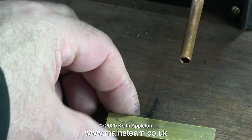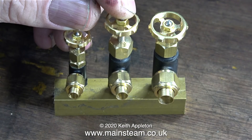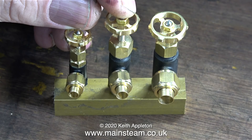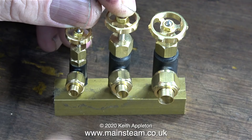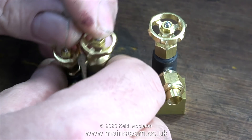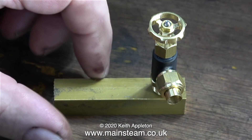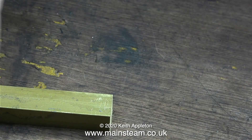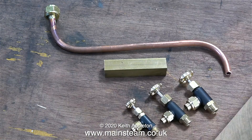I'm going to make a special three-way turret. Here's the idea: three taps — one 3/8 by 32, the second one 5/16 by 32, and the third one a quarter by 40. This three-tap turret will accommodate three pipe sizes: quarter, 3/16, and 5/32 inch. In this video I'm making the tap part; there will be a base, but I'll do that in a separate video.